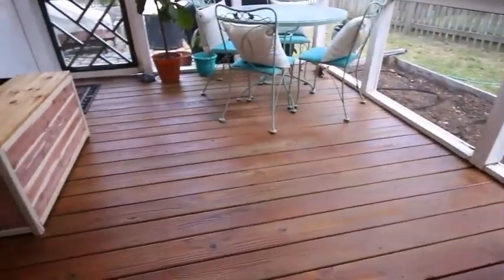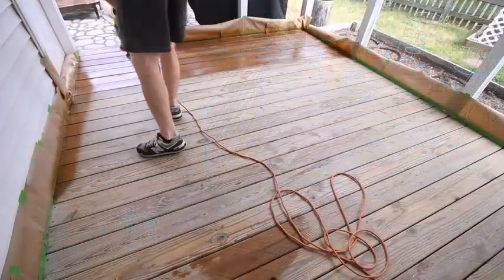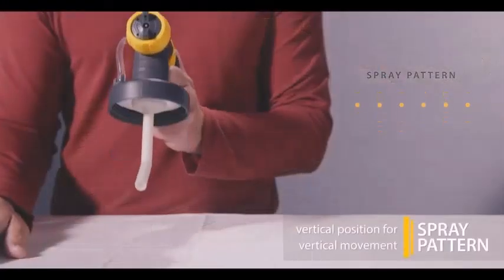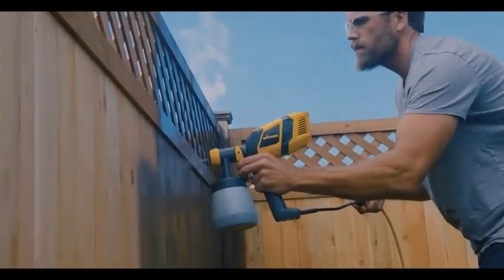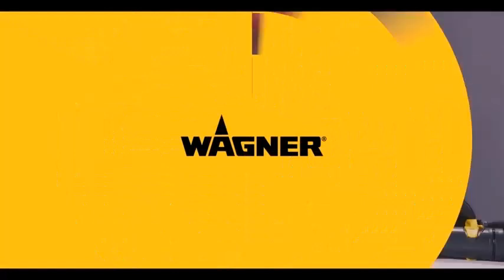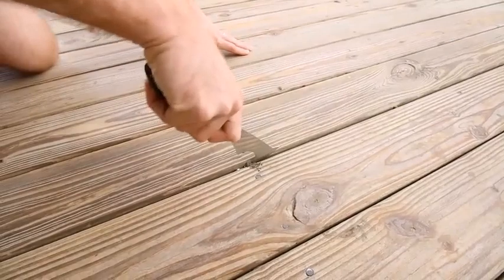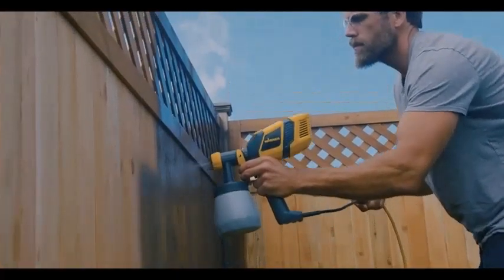If you are a beginner, you can use a paint sprayer, but you must practice using it before painting the item you plan to paint. Get scrap plywood or scrap materials that match the type of material you plan to paint. Get a feel for handling the gun, practice moving the spray from side to side, and look at how the paint spray is affected by moving closer and further away from the object. Also wear old clothes that you don't care about getting ruined by paint spray.